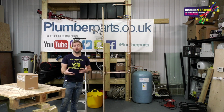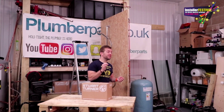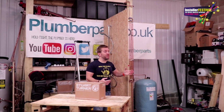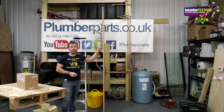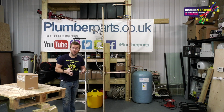So before I tell you how to fix this problem, how to get it going with one of these pumps, the first thing you're going to want to do is make sure you get about 1 litre of water a minute when the shower is in the normal operating area. Easy way to do that is to get a stopwatch out, turn your shower on, start the timer, and see if it fills up a litre jug and overflows in a minute. If you've got over a minute's worth of water coming out, you'll be able to use what's called a positive head pump, which is what we're going to be installing today.